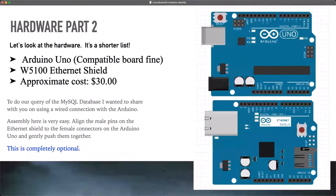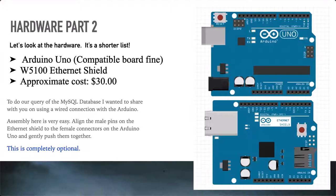I included another part of hardware here because I thought some people may not want to use the WiFi — they may want to use a wired connection using an ethernet shield. The cost of the ethernet shield and the Arduino is about $30, roughly $15 each. To connect the ethernet shield to the Arduino, you just align the male and female pins and then gently push them together. So this gives you the option to use it wired instead of wireless.